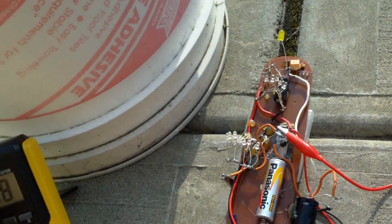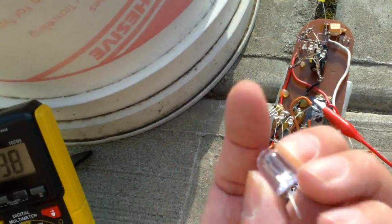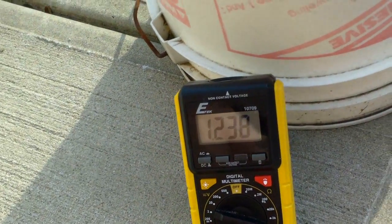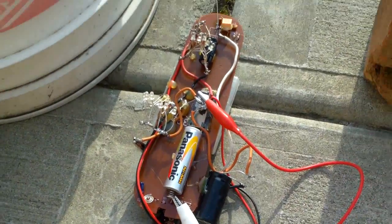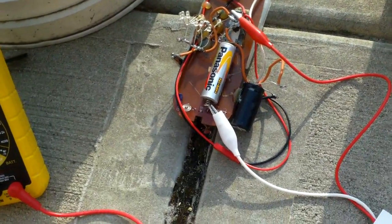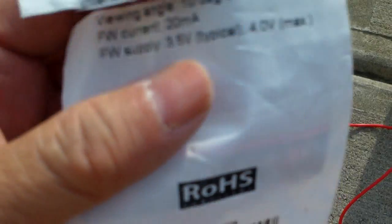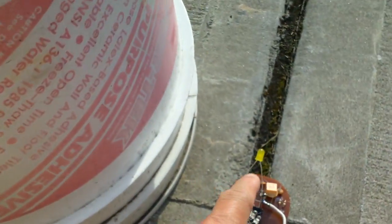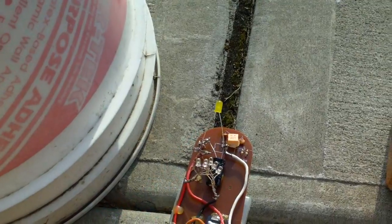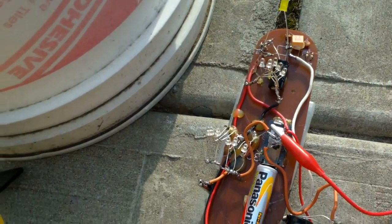I hope the sun didn't burn up the LED here - maybe that's what happened. Right now I'm almost at the end of the day and it's 1.38, so that's the update. Obviously it's taking quite a bit of sun to bring this up, and you can see why - the LED is only rated at 3.5 volt, 20mA for this big 10mm LED. That's going to be 20mA or so at about 2 volts with the yellow LED, so it's going to take a long time to charge.